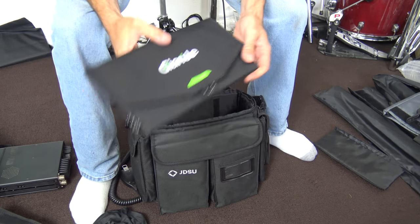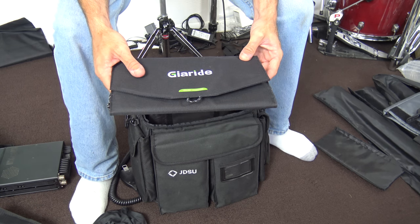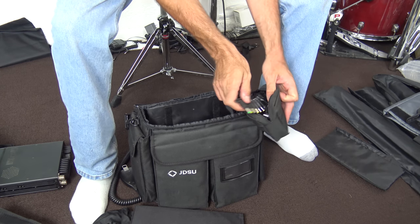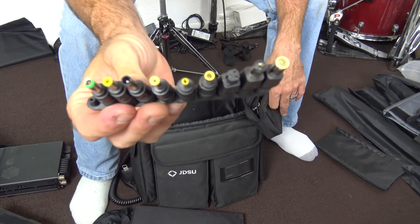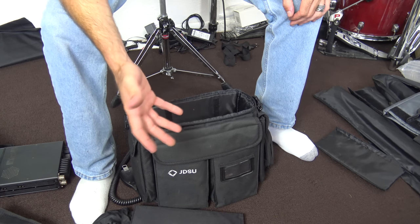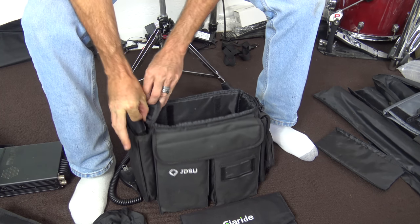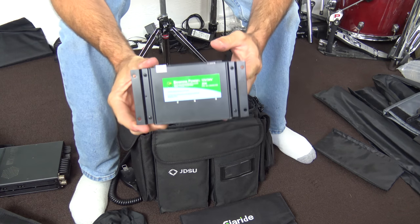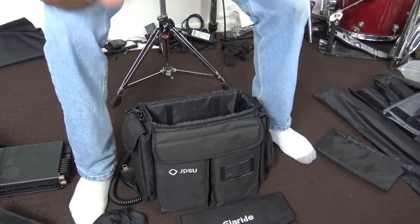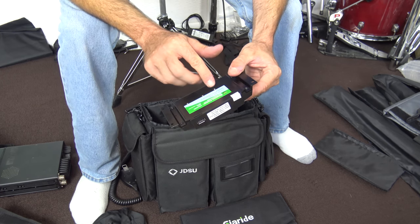The solar panel won't power the rig by itself — it's about a half-amp output — but it came with cords and various DC power jacks. It can't power the laptop exclusively on solar, but the BioEnno version apparently can. Using something like this is best recommended with a charge controller. I picked up a charge controller from BioEnno specifically because you have to get one capable of charging lithium iron phosphate batteries.